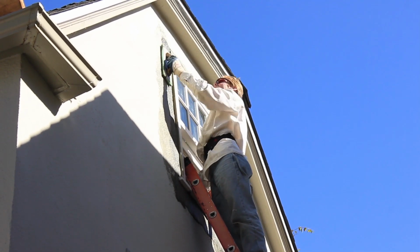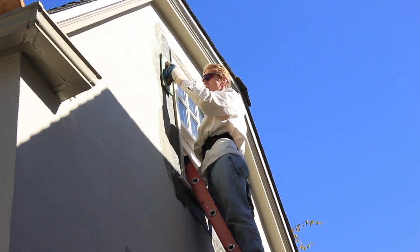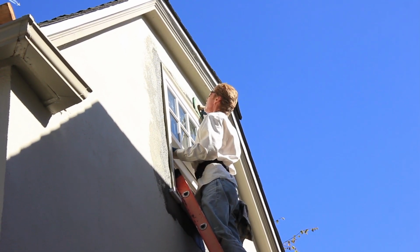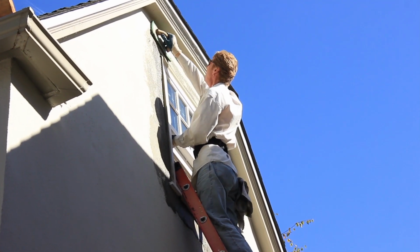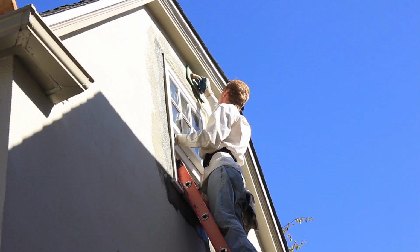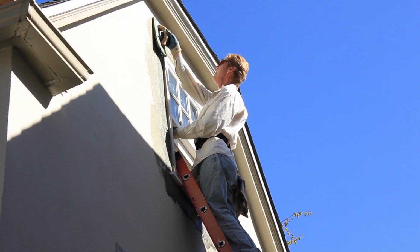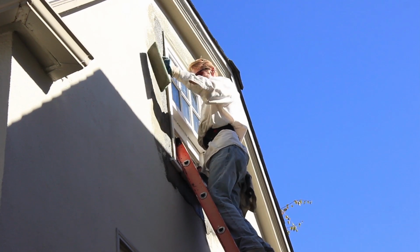All right, I finished this top piece off, and now I'm going to do above the window because there's hardly any water left in this float, and I didn't want the water to spill all over it. But at the same time, there's enough water to get my texture. There we go. You get that texture with feather in, make it pretty, so when it's painted, it matches as close as possible. There we have it. And there we have this side. Pretty close match, guys.